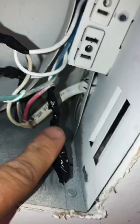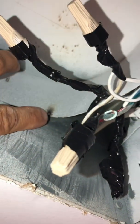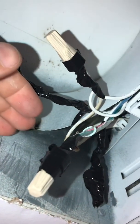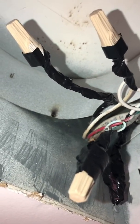What you want to do is stuff them back up in this compartment where they're far enough up so they won't be against the edge, because when the ceiling fan or exhaust fan goes back up in the ceiling it lines up and pushes right up tight against this. What happened is the wire was in between this and the piece of metal, chafing between the two until it finally arced through.